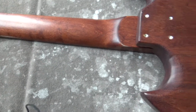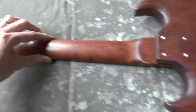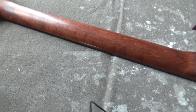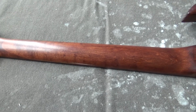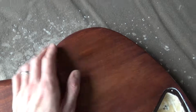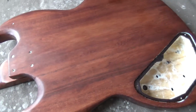I think it all comes down to the preparation of the wood. I clearly haven't prepared it properly, so the lacquer has applied, maybe evenly, but the wood surface is uneven, so we're ending up with an uneven result. There may not be much I can do about it. Maybe I can't, but I'll give it one more round of this. I don't really want to spend another 3 or 4 hours wet sanding this thing, but I'm going to try and start from a higher grit and see whether it just needs to be leveled off.